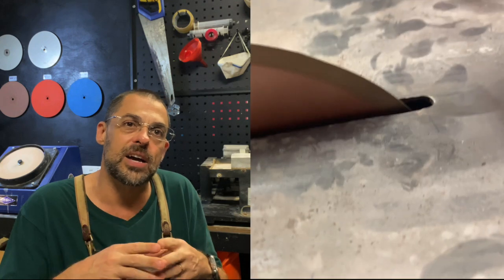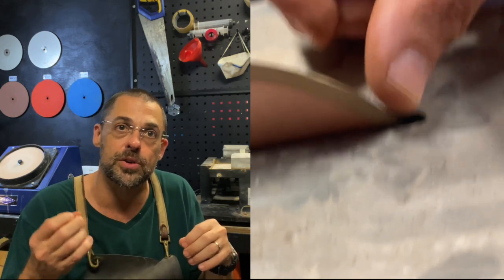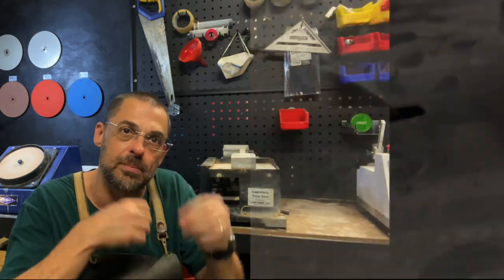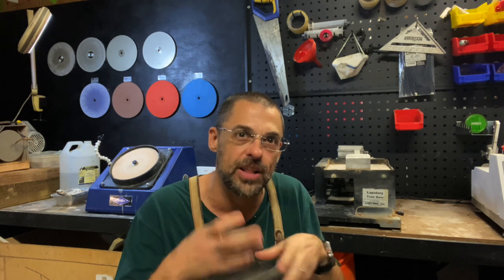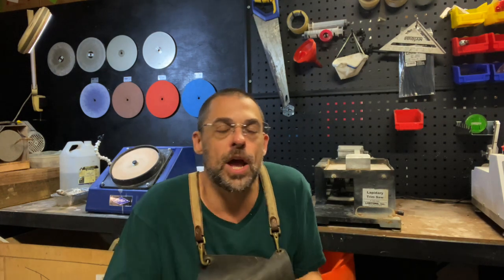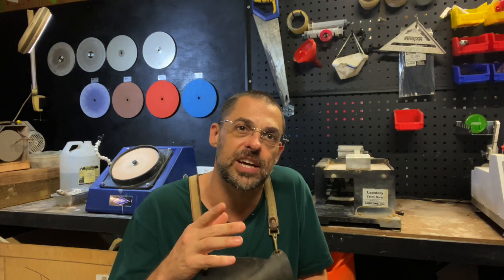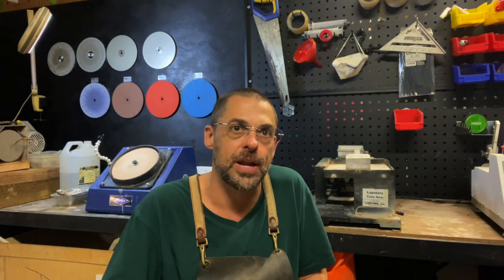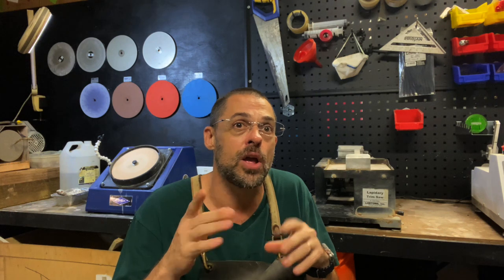Trim saw blades cut because they have a sintered diamond ring, which means there are diamond particles embedded in metal on the outside of the ring. Those diamonds, instead of cutting, essentially grind really fast in a line. That is kind of cutting in a way, but it's not the kind of cutting that can do your finger much damage if you just touch it on the edge. If you push on it really hard, yeah, it's going to hurt you, but you don't do that when you're cutting. But that's not how I got hurt with this saw.